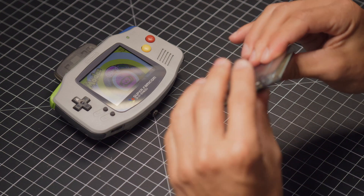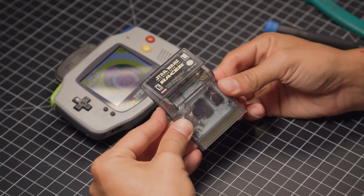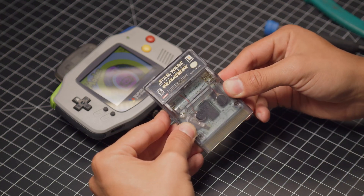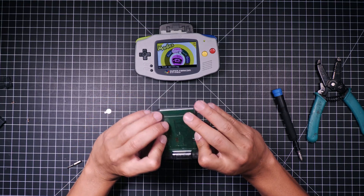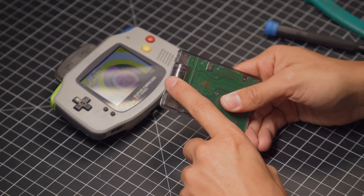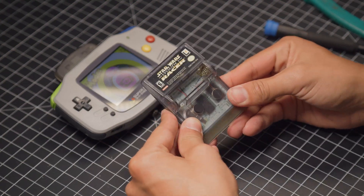I did try installing one of these motors to replace the motor in a Game Boy Color game and it does work — it isn't really as effective, but when I added a second one it was actually pretty close to the strength of the original rumble. There is room to fit two inside the cartridge housing, so in theory this could be a cheap fix for the GBC rumble carts as well. I'd probably put them up here and you could fit both of them right in here, but this is just to show you could also fit them in the front.